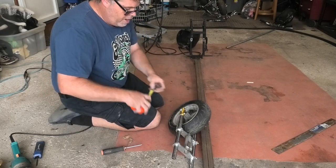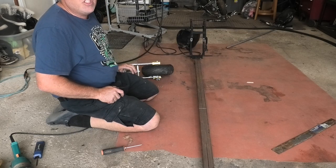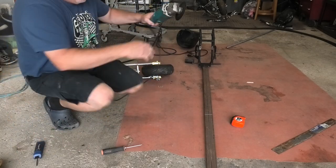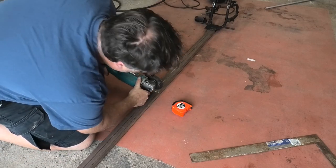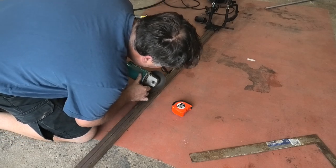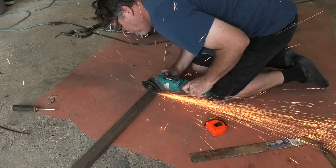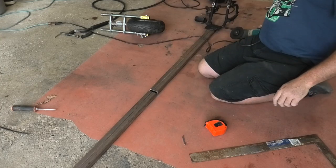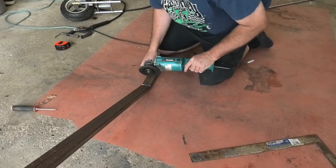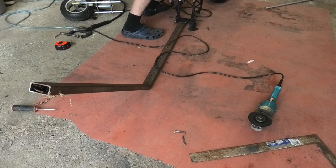So now we need to come up from the six inch ride height. From there we've got to come up nine inches for the center, four inches there — we need to come up five inches. We'll notch that out and bring her up and see if we can't get a five inch raise on her. Just cut halfway through her, then notch it — go this way, then the other way. Might need just a little bit more and now bend that up. There you go. Give her another notch. There it is right there. Pull that up and tack her — let's get her done.